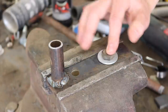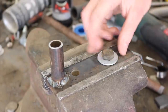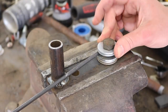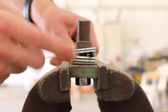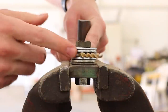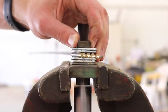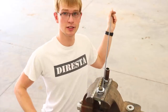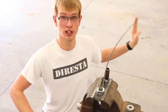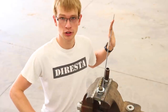My solution is to use a bolt so I can tighten the music wire in place so it can't pull. To offset for this weld I'm going to stack up a few washers. This is 7/32nds music wire, so to stop these washers from tipping, just put a 7/32nds drill bit on the other side and then tighten the bolt. Be aware the end of this is small enough and sharp enough it can break skin — if that gets away from you when you've got a bunch of tension under it, it can go fast. So use your head.